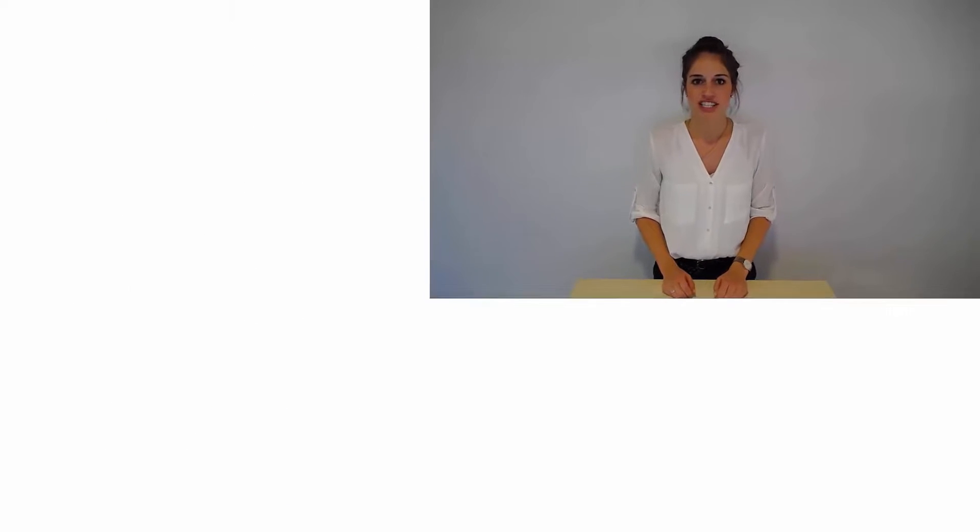The typical wear of contact material as seen in standard electromechanical devices is eliminated thanks to the smart use of semiconductors. All in all, the technology enables a gentle switching and consequently a long lifespan, because the relays are prevented from the switching that would usually cause arcs. You have just become an expert in hybrid technology. Thank you for listening and see you in the next video.